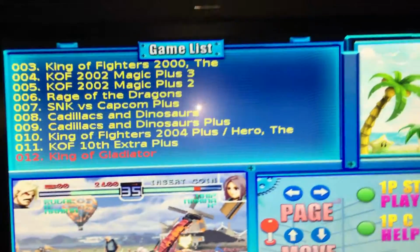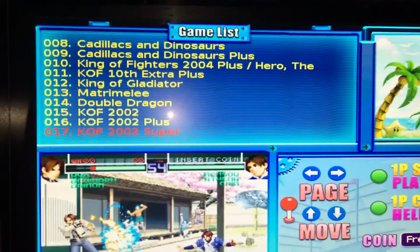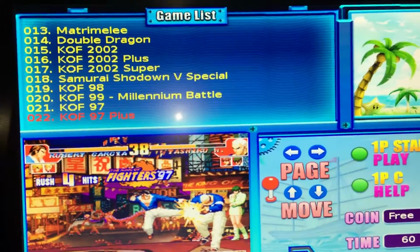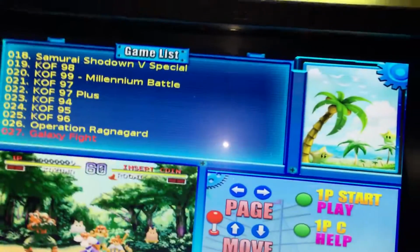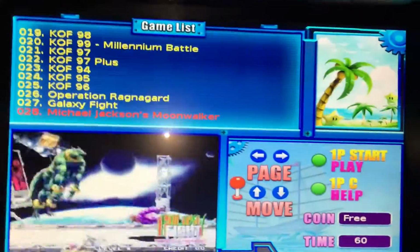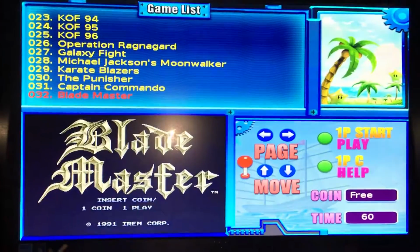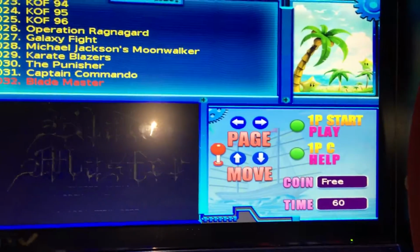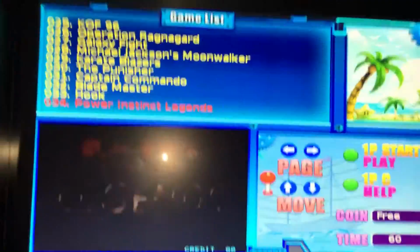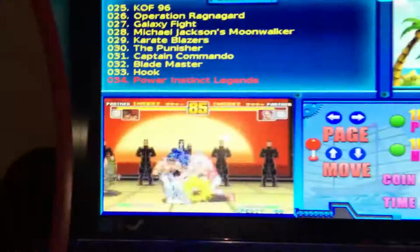Now, we don't have the time to go through all 600 games that are on here, but I did want to show off what the machine looks like running, the graphic quality. The board I'm using, the GameElf board, has a couple of different options. It can simulate, or it can actually connect out and simulate, if you're on JAMMA, standard arcade graphics, or it can do two different resolutions for LCD VGA graphics. I obviously chose the higher resolution VGA, and for most games it looks pretty good.